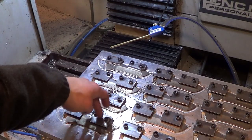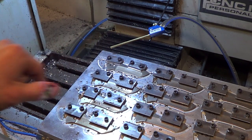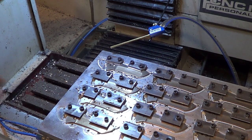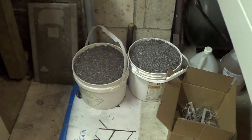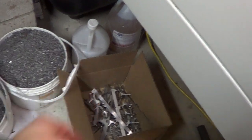These clamps are 4140 steel. No real reason I picked that — just to give me the option to harden them if I wanted to. I've got an air blast on the fog buster there just because I didn't want to make a mess with coolant. I just cleaned up pounds of titanium from the mill so that wing is clean. I've got two buckets full of titanium scraps — I had to stomp those down to make them fit — and the bigger chunky pieces are in this box over here.